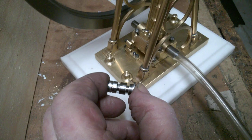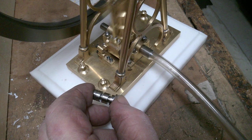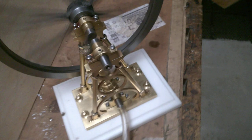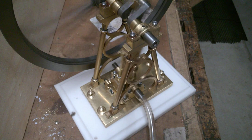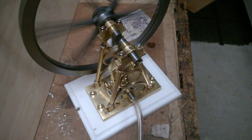What's notable on this other valve are the milled slots that go from the inlet groove — an axial slot that runs to the center of that middle piece, which directs the air to the cylinder top and bottom — and also exhausts two other slots that do the exhaust. I'll probably have to do some pictures and explanation on that valve and exactly how it works. It seems to be plenty of motion and plenty of good air flow, even though the air passages in there are only 3/32nds of an inch for the most part. It seems to be adequate.